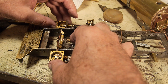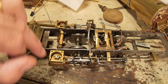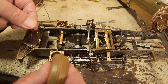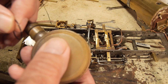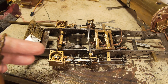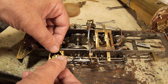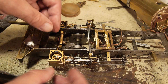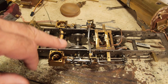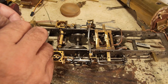Both sides are in — that's looking good. I'm going to put the top covers back on, putting a little bit of oil around the top to help the O-ring seat. This is cylinder oil, by the way. Just a little bit. Place the O-ring back in — I really like the way these cylinders seal. It's a much better design than having a gasket; the O-ring seal is a lot better and a little less problematical.